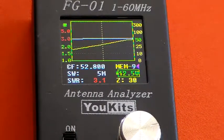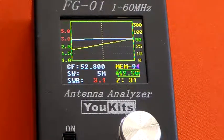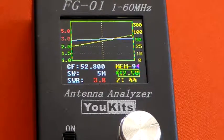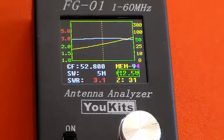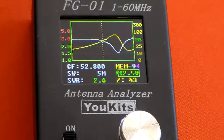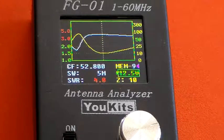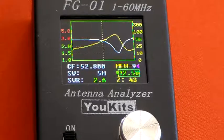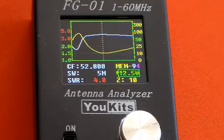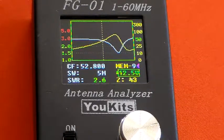So we're just going to move the inductor around for the minimum SWR. We'll take the inductance out as we go around. You can see the SWR and the impedance changing there — that's 2.6 at 43 ohms. That's not bad actually. So that looks to be about the optimum. We go past, we take a bit more inductance out and the SWR goes up — it doesn't quite like that as much. So we'll use the inductance setting of I.